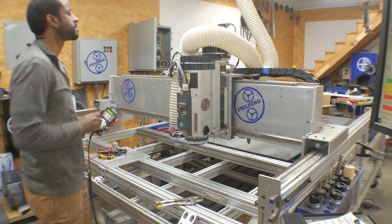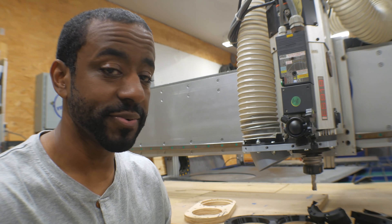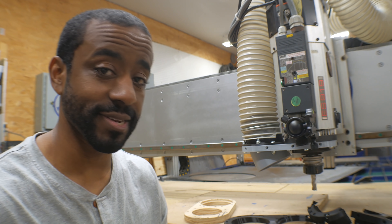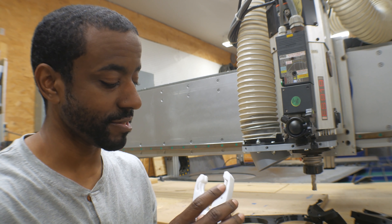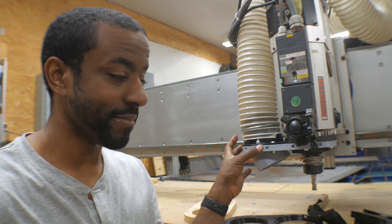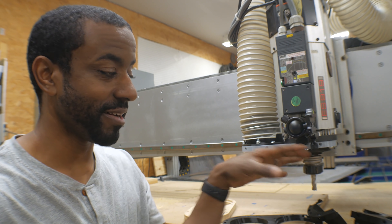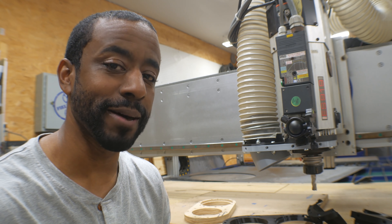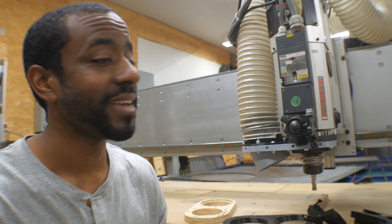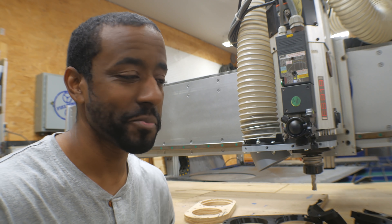Here I'm just navigating the head of the CNC around to make sure that the hose doesn't get tangled or caught up anywhere. There's one more issue to resolve: this spindle is capable of automatic tool changes, and I definitely plan to add a tool holder to the side rail. The issue is these two have to interact — I have to have my dust collector shroud in place, but also be able to go over, drop off a tool, and pick up a new tool without interfering with the dust collector. So I've decided I've had enough engineering problems for this project for now. In the meantime, I'm just going to enjoy the fact that there's going to be much less dust to sweep up and breathe in.